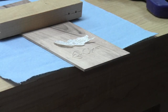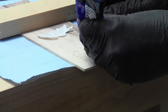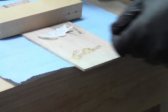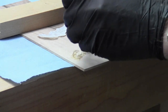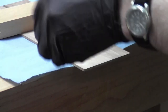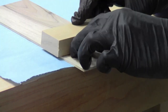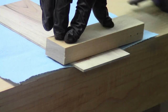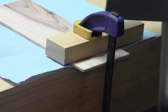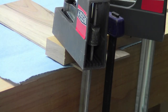One thing I'm worrying about is this end piece does not feel as well seated as the rest of it. I'm trying to make sure it's in as far as it's going to go so it doesn't shift as I lay the caul down. I can hold the caul down and grab the clamp, set it right here, and hold everything in place as I go after the real clamps — really cinch down on this. I think that will get me a fairly well clamped piece when there's glue on it. So we're going to grab the glue and see how well we can seat this.